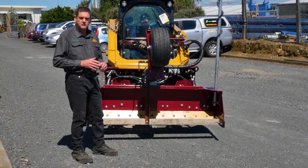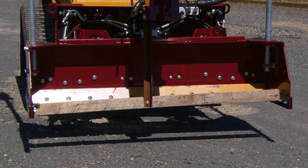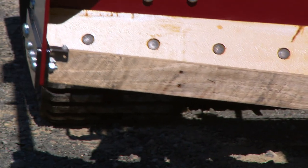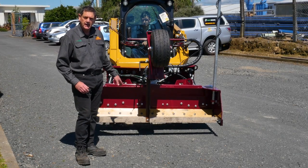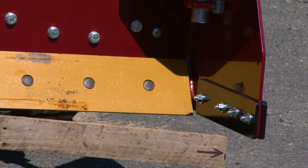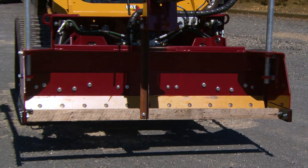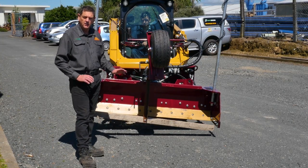So we're going to demonstrate that here. Here we have our Sharp Grade set up with our imaginary center pivot. Here's the center pivot, and here's our blade connected to this side — you can see the arrow showing the movement that is occurring in a center pivot blade. A center pivot blade is the worst combination you can ever have. There is nothing smart about a center pivot, and this is what you find on six-way blades and most box blades.